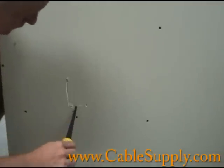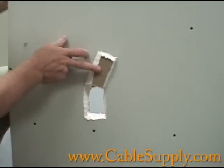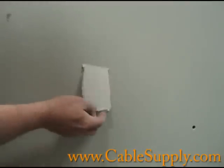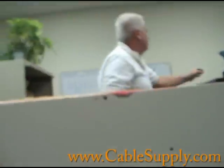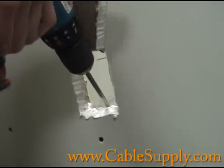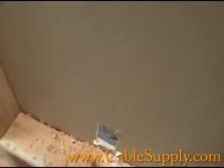You're going to stick this through and then do everything you can to pop that out. There's my nice little hole. When it's time to cover it up, it's easy to spackle that down — it's an easy repair. It doesn't go all the way through, so it's a nice little flap. I'm going to take my drill and stick it in here and cut the hole through the fire break. You can see how the hole goes through.